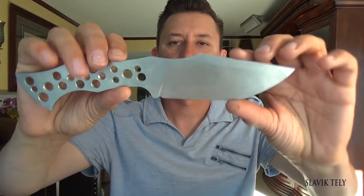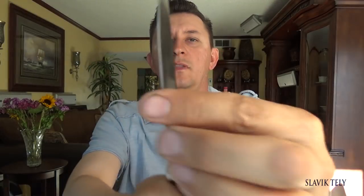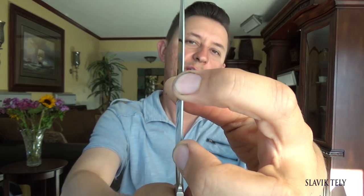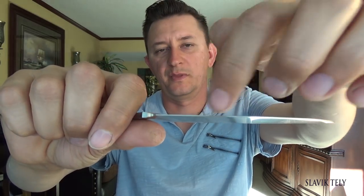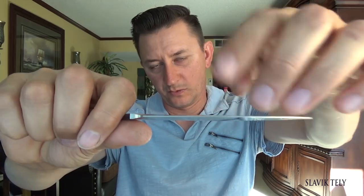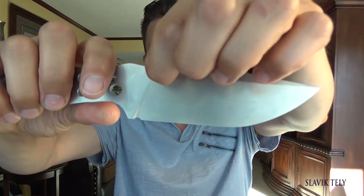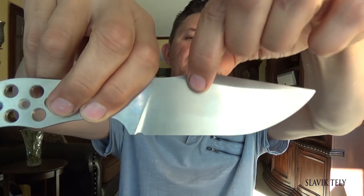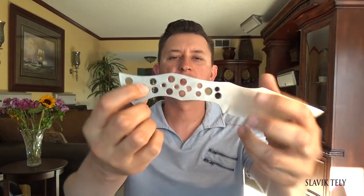What I usually do — take this knife for example — I leave the edge about one millimeter. Scribe two lines one millimeter apart; that's your center, you don't want to go past that. Then you have a bevel line at the top — whatever that angle is, you've got to match that line all the way across. So there is no specific angle to grind.